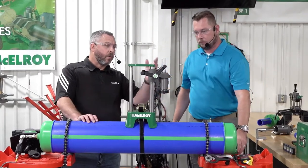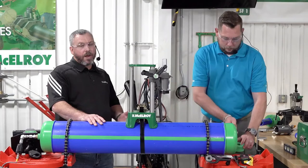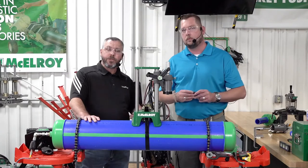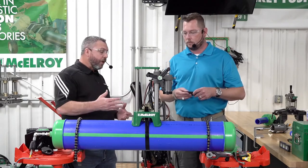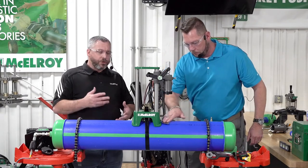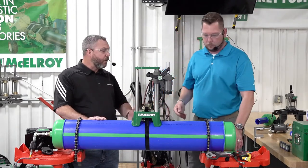With the Hornet and fitting adapter with load cell installed, we know exactly where we'll do our saddle fusion. Next we need to prep our pipe and fitting. We'll use 50-60 grit utility cloth to abrade both pipe and fitting, then follow up with alcohol. Some procedures call for abrasion, some just alcohol — but we're starting with abrasion to remove that very fine layer on top, removing oxidation or possible contamination on the film of the pipe itself.